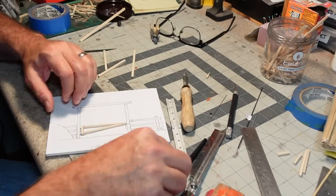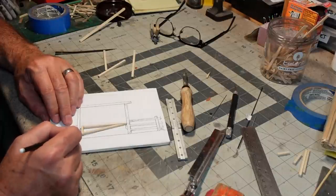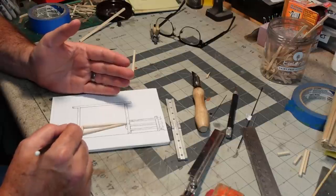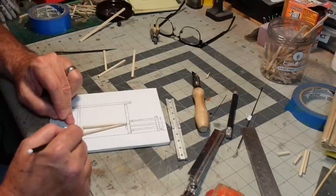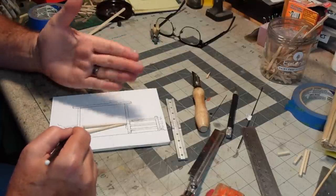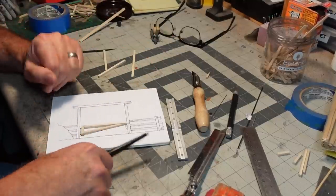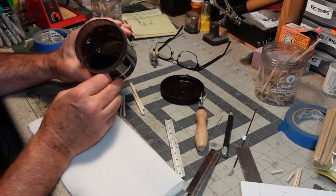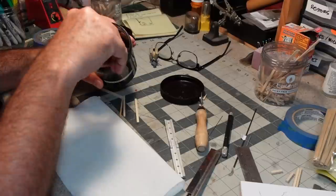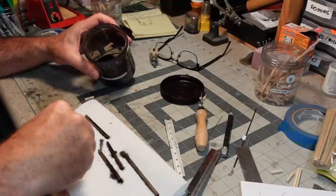On my drawing I've left a fairly generous gap between the hinge side of the gate and the post, because if it's going to swing both ways you need room to accommodate that. If it were flush against the post it could only swing out one way. We've got some shoe dye and rubbing alcohol stain already mixed up from a previous project. Just a quick dip is really all you need — you don't need to soak it unless you want it really dark.